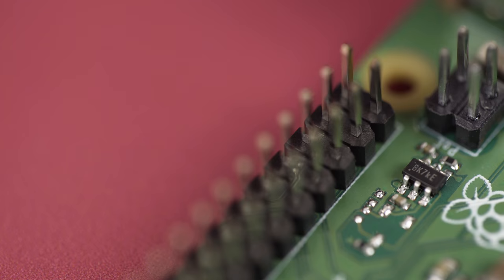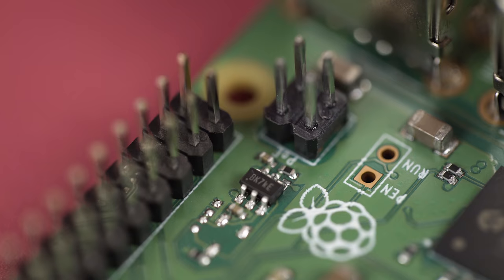You'll notice we've grown an extra header up here. Part of the change for the new Ethernet was that we added Power over Ethernet transformers. These are the taps from this transformer. This will allow you to plug in a HAT board launching soon that basically allows you to power your board over Ethernet — 48 volts coming in on the Ethernet cable, comes up through that header, onto a HAT which regulates it down to 5 volts and then injects it back in through the GPIO power connector. And it also adds a fan, should you need one.